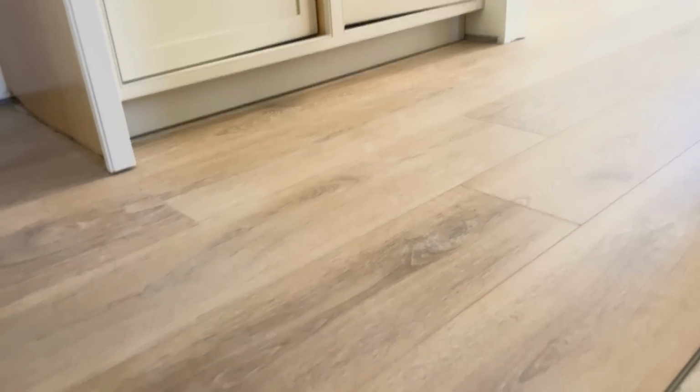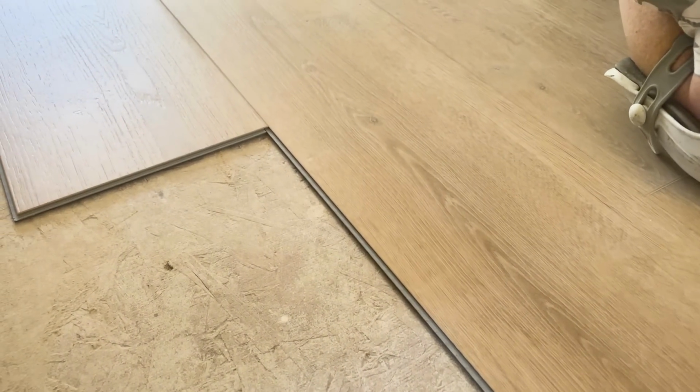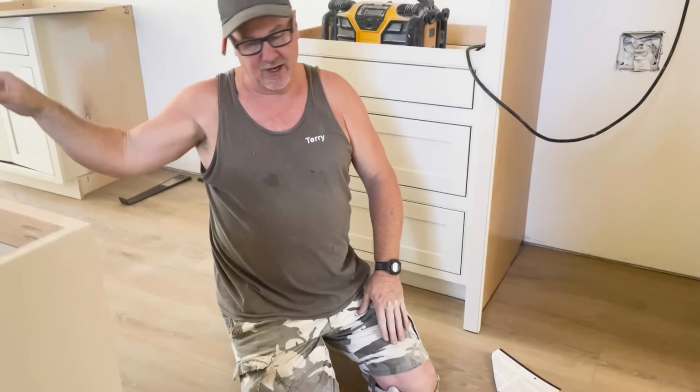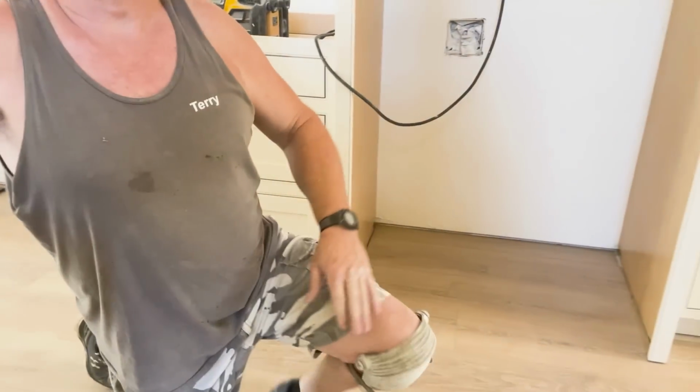The stuff that's super flat, if it gets one little lift at all, like if the thing lifts out and then the edge sticks up, as soon as you slide something over, it chips it. Got it. So these little micro bevels keep it from anything ever catching the edge. With super cheap stuff you don't ever get the bevel. Over time, on a sunny day, you'll look down your floor and you'll see little edges. But the little bevels, that's a sign that you got some good stuff.